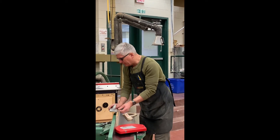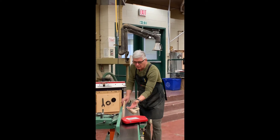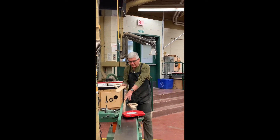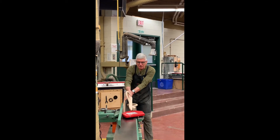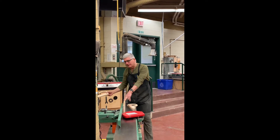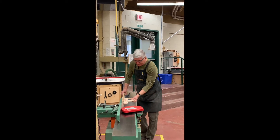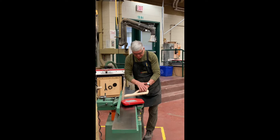I'm not going to use the flat push stick anymore — I'm going to use a push stick on the side. If my board is lower than the fence, I would need two push sticks to go over the blade. It's very important that your hands stay away from the blade surface, even if the guard is in place — fingers that get caught in there are not going to come back. In this case I only need one. I prefer to use the push stick like this — I can hold the board tight against the fence and my fingers are way out here away from the blade.